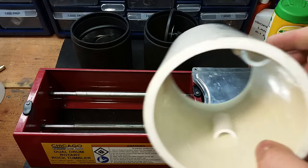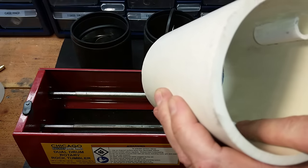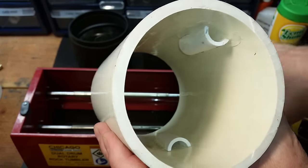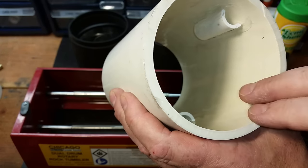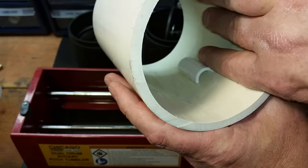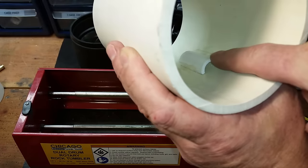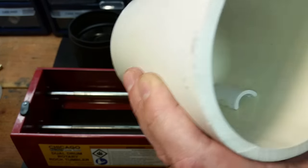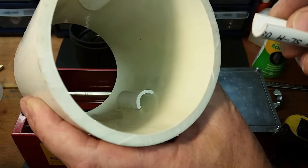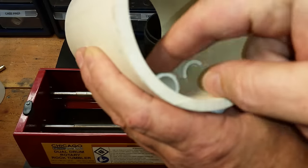Back to the little nubs. One of the reasons I went with a low-profile nub is I didn't want to put big paddles there, because this motor isn't very strong. I didn't want a lot of torque to overcome a big pile of mass piled up behind a long paddle. I just want a little something there to break up the rotation and spin those cases around.